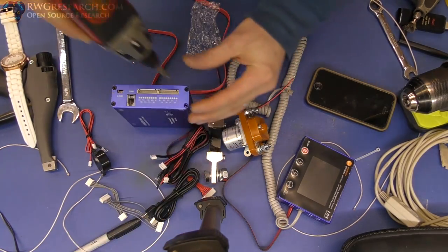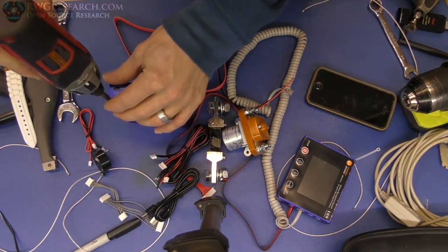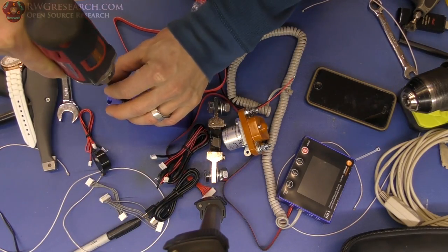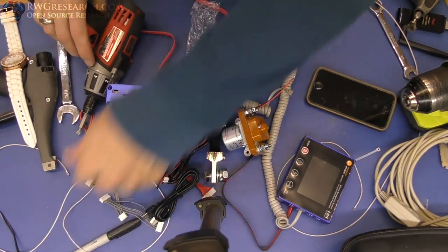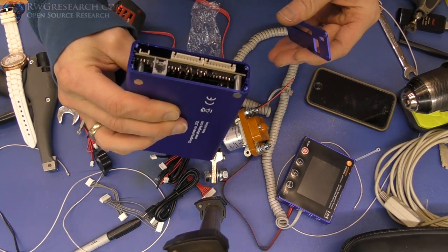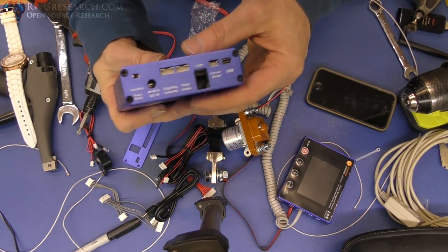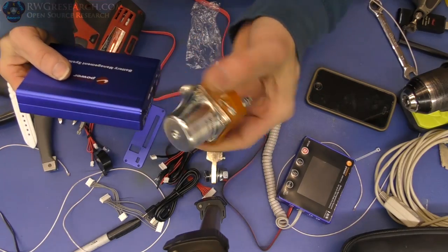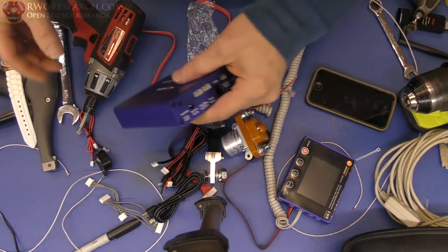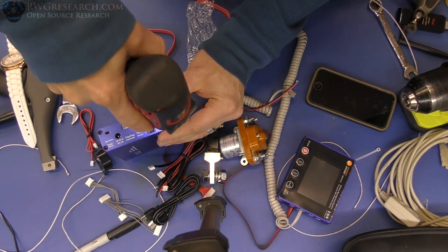By the way, this is a battery management system and a monitor system all in one. And that's the reason I bought it, because I want to be able to monitor each one of the items inside of my unit. Now this unit itself will not cut the battery. You have to put an external solenoid or something to cut the charge or discharge. In my case, I'm just going to monitor the discharge, and then the charge I could hook up to this if it was overheating or something.